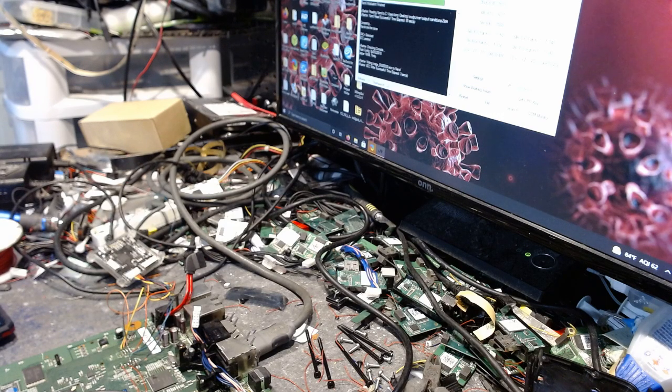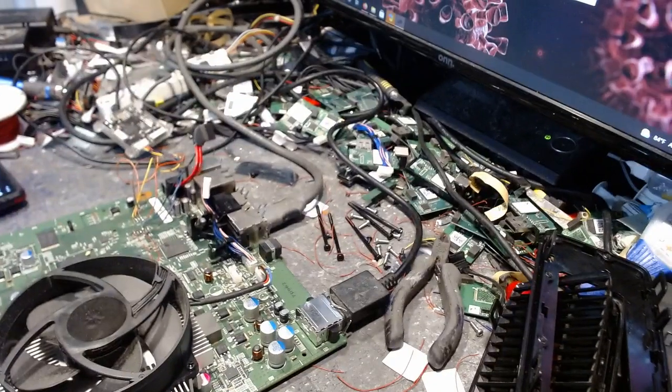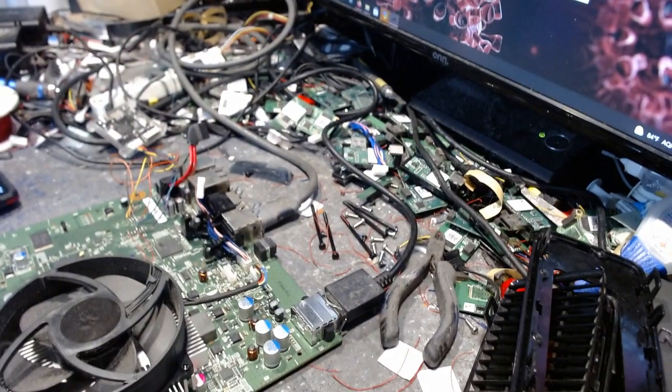Here we are. Now it's decrypted the NAND, everything is fine, as you can see. Files are moving, life is good. And now we're going to create the XeBuild image. Great, here it goes. I don't need you seeing that key that's coming up. All right, there we go. And now we're going to write the NAND.